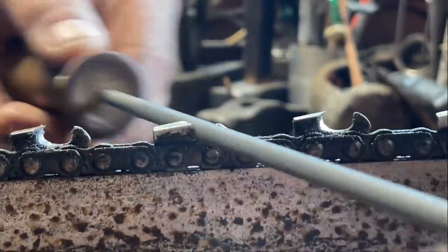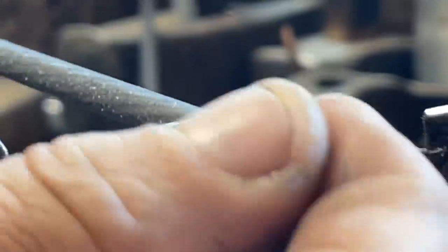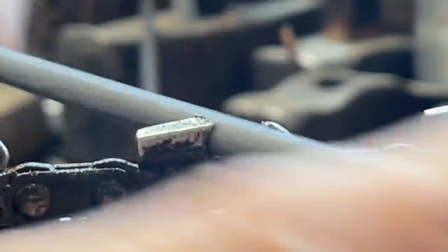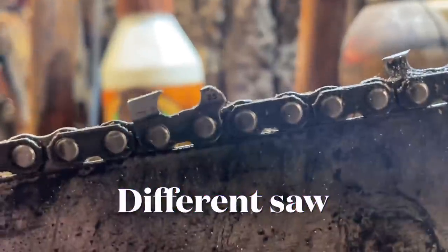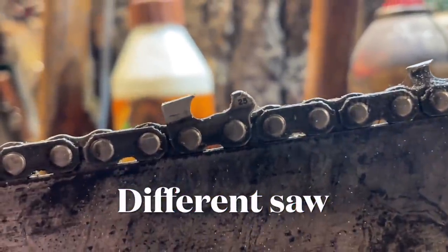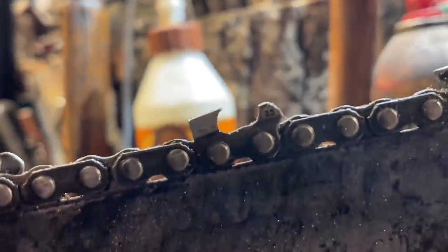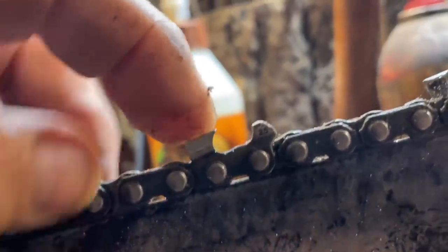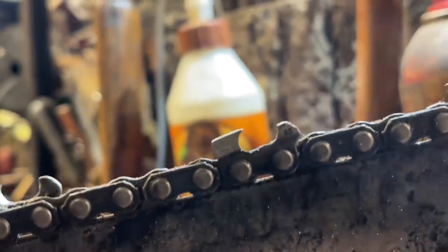There, now I'm underneath the top plate. You'll notice a burr if the camera's set right. I don't care about how many strokes. It's about getting the tooth filed. Now, if there's too much hook, friends, your top tooth is going to bend over. Look at that. They've pulled way too much gullet. That's very aggressive. It's too aggressive in my mind, because your top plate, even if you don't hit something, takes a thrashing, friends, when you hog gullet like that. You don't need that much.